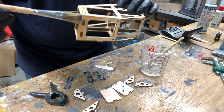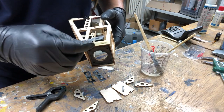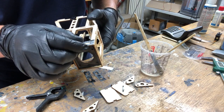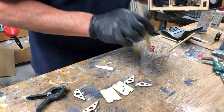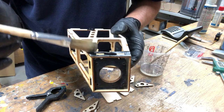Now let's install the carbon fiber pieces. We have sanded them beforehand so now we can just install them right there. Remember that we sanded them from both sides. The reason is that now we're going to apply epoxy on the outside as well to strengthen the whole setup.